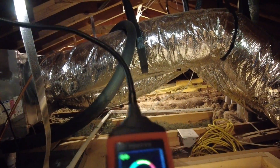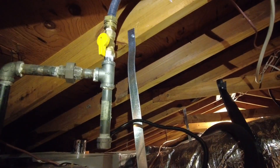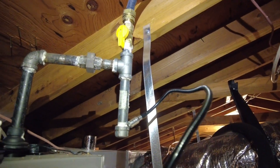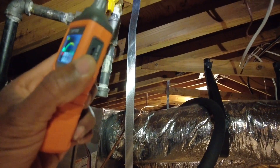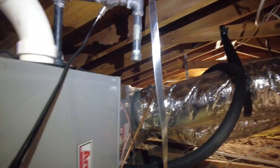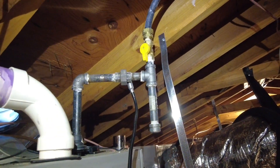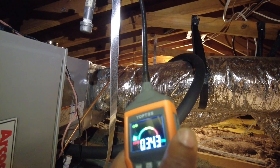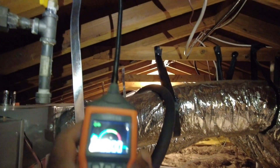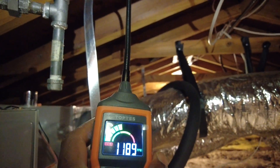So yeah, this thing is super usable, very sensitive. I'll check all of my fittings — see if I can use that gooseneck just to get around the back side of the black pipe here. Like I said, I'm looking for even before the beep, I'm looking for small hits. You can see it definitely starts reading parts per million before it even starts beeping. It starts reading parts per million much sooner than the beep. That's really good — when it gets strong enough, it'll start to beep.